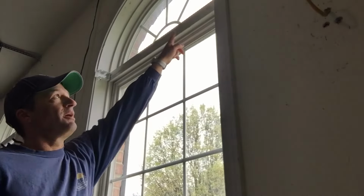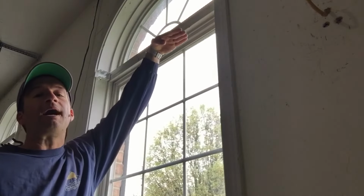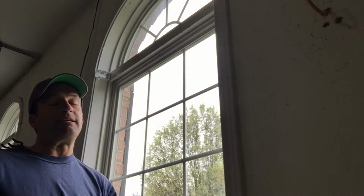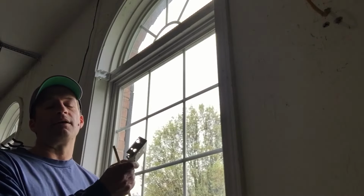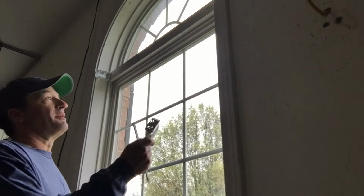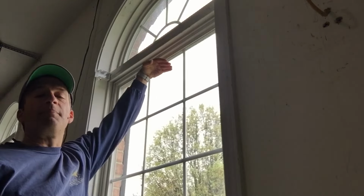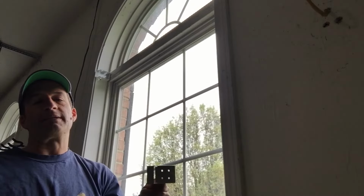We don't have that option here, right? Because we have this strip of material that goes across, but there's nothing stopping us from putting our other bracket too high across from the one that we installed, thereby making our blinds uneven and not level. So we are going to have to put our other bracket on the end of our blinds, make it look like we are installing the blinds, and then make sure we have a level on top of our blinds to then ensure that we are installing our other bracket in the right spot so that everything looks even and balanced and level when the blinds are installed.